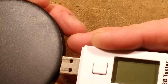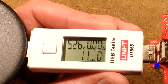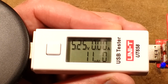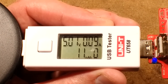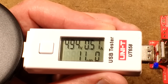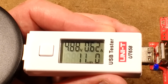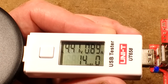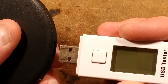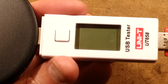Let's wake it up again. 5.2 volts — let me double check — yes, it's in focus, 5.25. At 260 milliamps, at 600 milliamps it's dropped to 4.87, 800 milliamps 4.66. That was it — at 1 amp it cuts straight out.